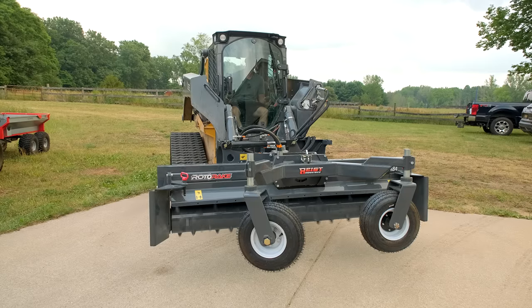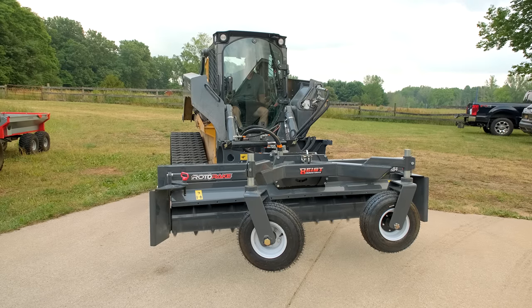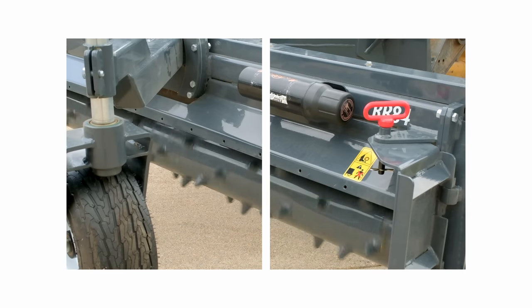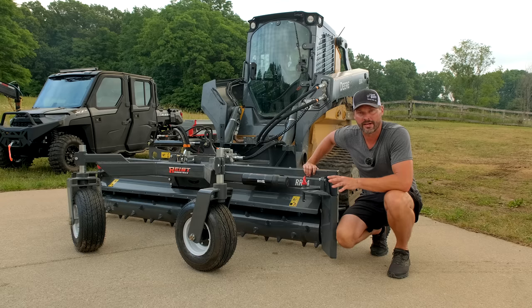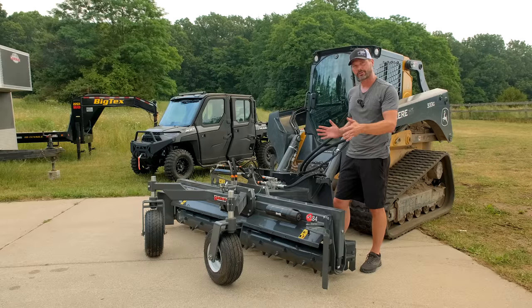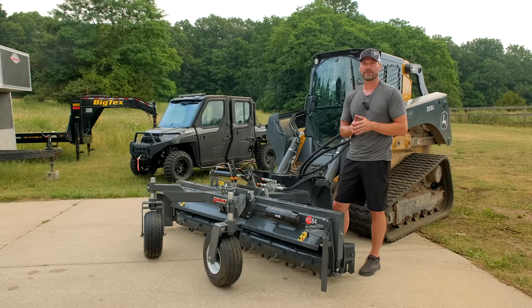This is a 10-inch diameter rotor that is bi-directional — it can go forward or reverse. It is equipped with tungsten carbide teeth to last for years, and it features a dual motor design driving 40% more torque than the original. It also has 25 degrees of angle and 28 degrees of tilt, giving you a lot of flexibility to contour the land how you see fit.